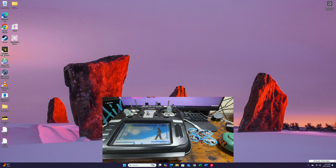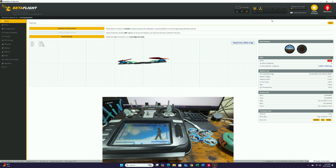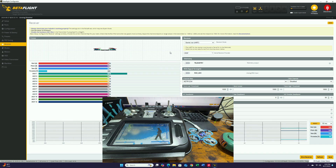Go to the software called Betaflight — if you don't know where to download Betaflight, the link is below. Once we have connected to Betaflight, hit connect right here. Most of the stuff should be already set up, and since this is a Bind and Fly, all the stuff should be activated for you. What we have to do is come to the receiver tab and make sure to see if this drone is receiving any stick inputs. Currently there are no stick inputs, so we will have to go into our system and run the ExpressLRS Lua script.